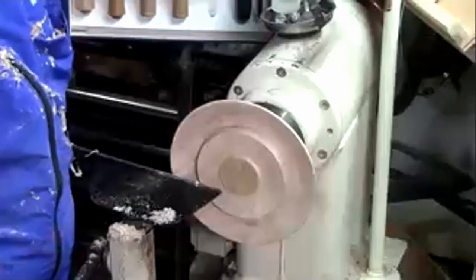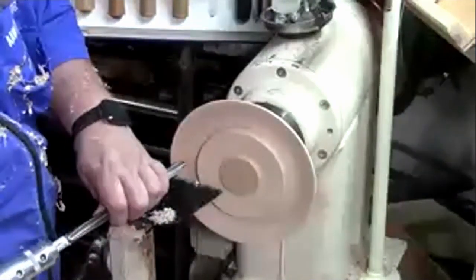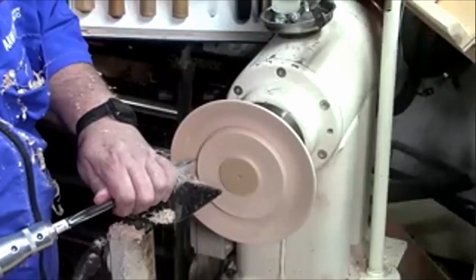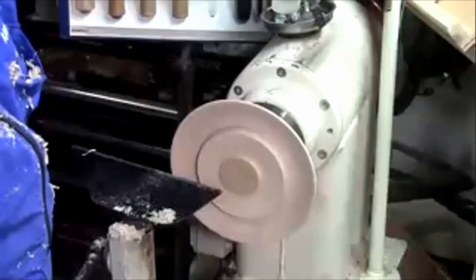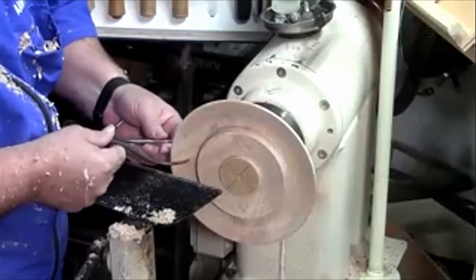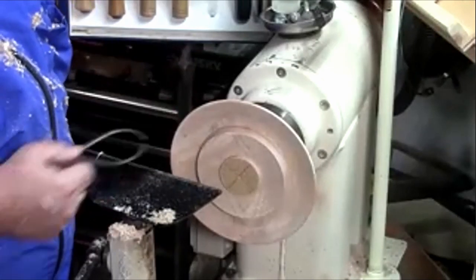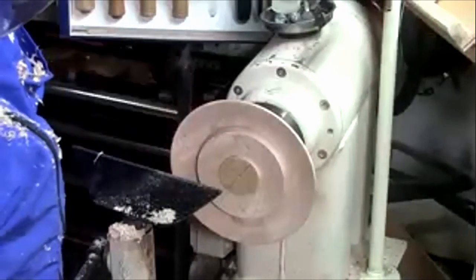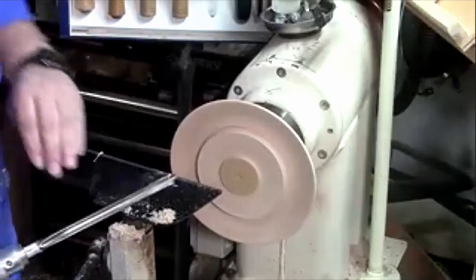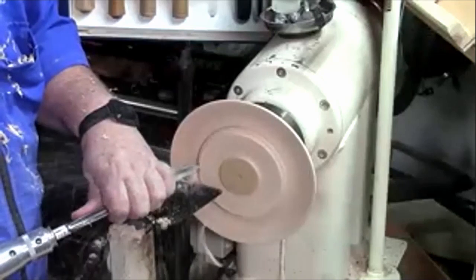just a tad more and we'll be into the bottom. And that's when we don't want it to be quite as thin. We want to allow just a little bit more. Because again, we've got a 1/8 of an inch recess. So we're good to right there. And that's where we're hitting the flat part of our bottom going across. So at this point, we're going to go ahead and take us another inch.